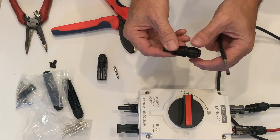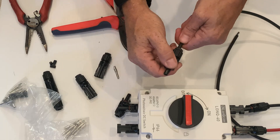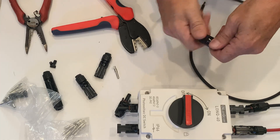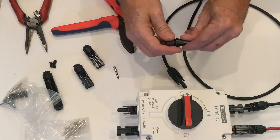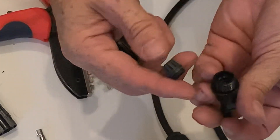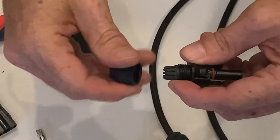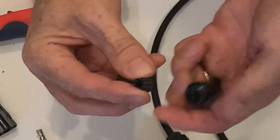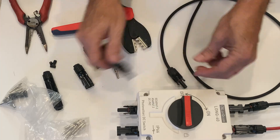The rest is pretty easy. As long as this is not too tight — it just needs to barely start to snag — you should be able to slide it right in, hear it click in place, and then just tighten this down to squeeze the rubber washer on the inside. On the inside of these, this rubber gasket is right here, and when you tighten it down it pushes in on that and squeezes the rubber gasket on the wire, making a waterproof seal. That's what you're attempting to achieve by tightening this down.